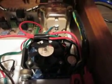This handle — I'll try to make a wooden handle which will match the box, but I have to figure out the insulation inside because it's high voltage and I don't want any leakage. I put a glass top on it so you can actually lift the top and see inside. There's a transformer in a corner, a ZVS circuit, a flyback transformer, a spark gap, a capacitor, and right here is the regulated power supply.